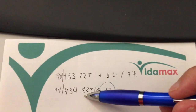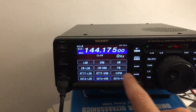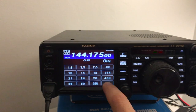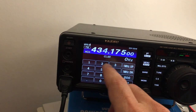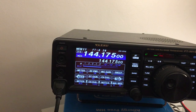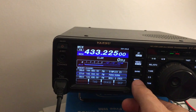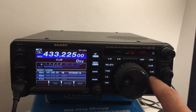We will set the tone frequency on the TX frequency. So without further ado, let's set it up. Let's move back to VFO mode FM. Here we go — band, set frequency 433.225. Let's find a vacant frequency — Memory 40, press and hold.